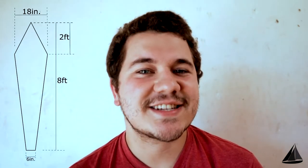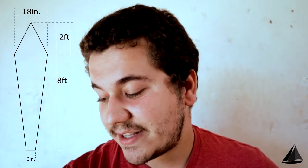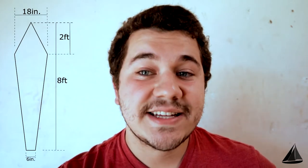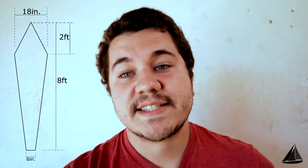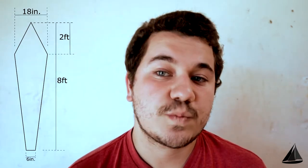I made a very simple design of a catamaran. A small catamaran — it's going to be eight feet long and about four feet between the center of each hull. The hulls have a very simple shape: flat bottom and also flat sided, to make the building process easier. It's more or less like a sarcophagus. The hull is going to be at maximum 18 inches wide at the front and 6 inches wide at the very back, with straight lines drawn between those points.